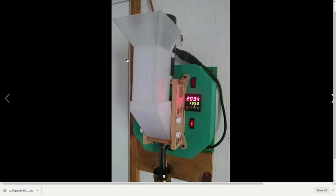Same controller as on a torch table, or on a big printer. Use that connected to sense the temperature in the heater element. For a heater element, you have bands, just these 1-inch bands, 120 volts. Get a 1-inch pipe, get a 1-inch auger through it, attach a motor to it, and you're done. Concept is simple. And the auger is something just off the shelf, and that should work enough to actually get us what we need.